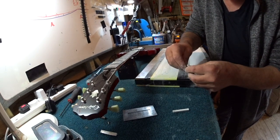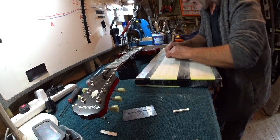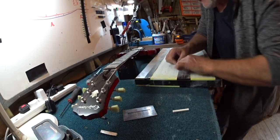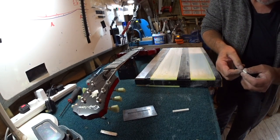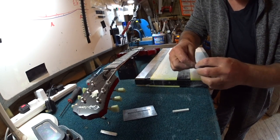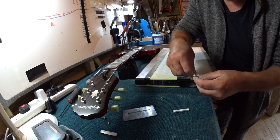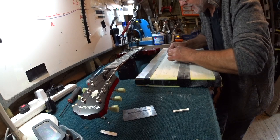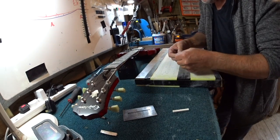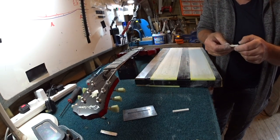It had before a sort of knurled end, which, that's got a bit more to do actually, that one, could end up, if we're not careful, drilling a bit more into the Milliput base, which I don't want to happen. So just going to sand that off. We're not too concerned about the underside of the unit itself, because it's never going to sit flat on that. What we're concerned about is just getting the screws flattened off. Not really many other ways to do it other than this. So that's the front edge. I'm going to sit it there. And also, when you're doing this, it turns the screw and pushes them in, so it's not actually a very easy way of achieving that. But that'll be an improvement.